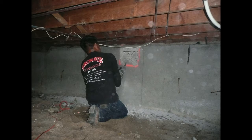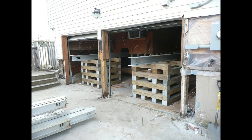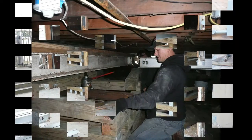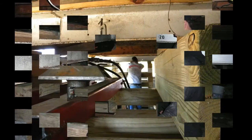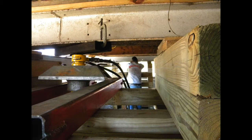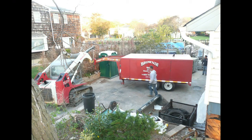We started by hiring Brownie Company, a very experienced lifting company, fourth generation. They came to the home and chiseled holes through our existing foundation walls, installed steel I-beams through those holes and through many of the room's interior. Those steel I-beams were supported on wooden cribs built with wood six-by-sixes, which also housed Brownie Company's unified jack system.